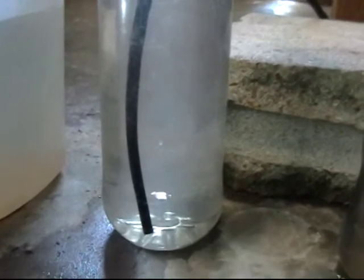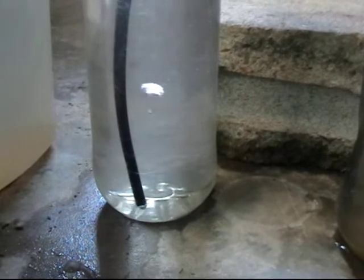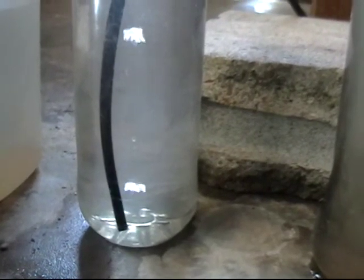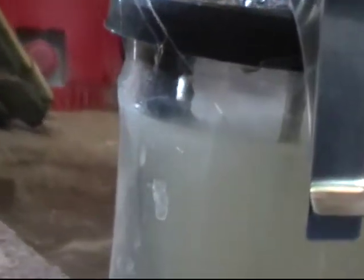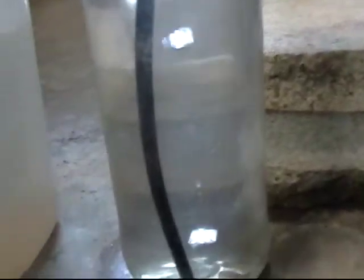Let's go ahead and go to 12 volts with 2 amps. Big difference. You can see it's starting to bubble a lot faster, and when it's warmed up it really bubbles better. There's the rods — you can see it's giving off a lot more, starting to fog up towards the top. There's the left rod producing hydrogen like crazy for the small container, and there's the right rod.